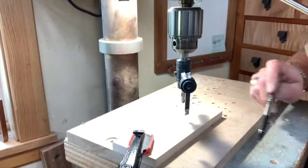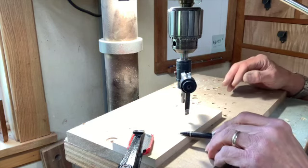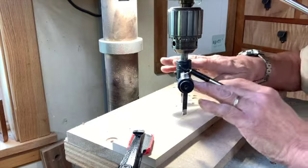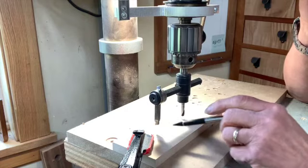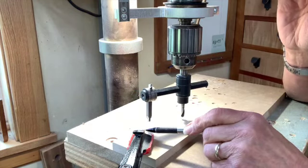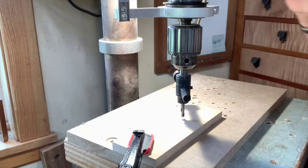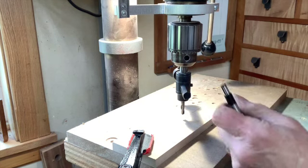We're all set up to do this job. I've taken the time to center punch that hard to make sure I'm on an absolute spot, and I've centered my piece underneath the drill. I've rotated my drill press table so that I can get a clamp over the end. Clamping is very important. If you've not used a circle cutter before, these things have a lot of leverage. They must be run at low speed and you cannot hold anything with your bare hands — it has to be clamped down.